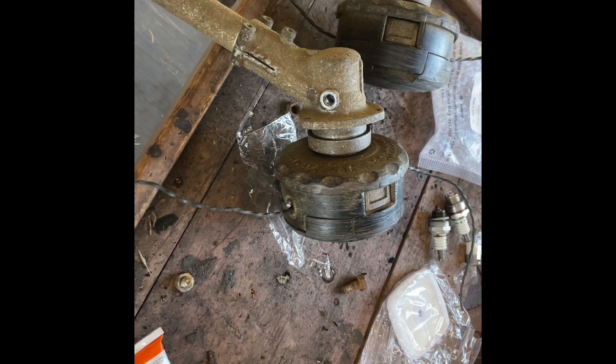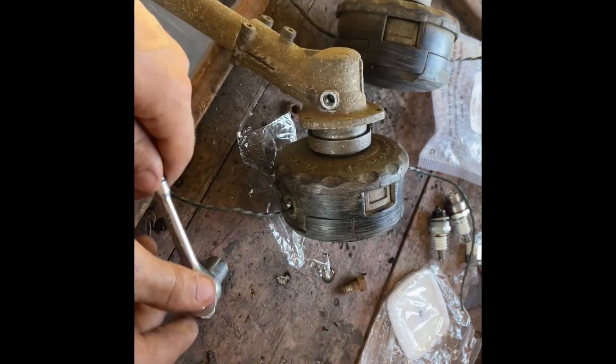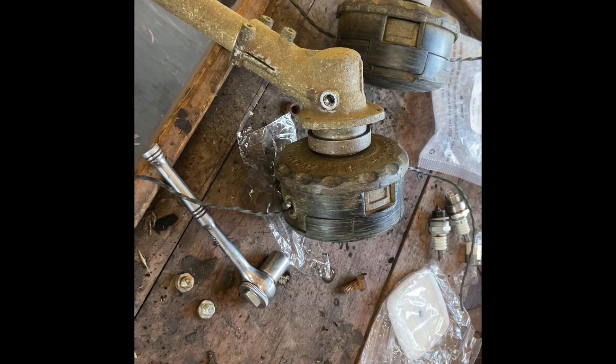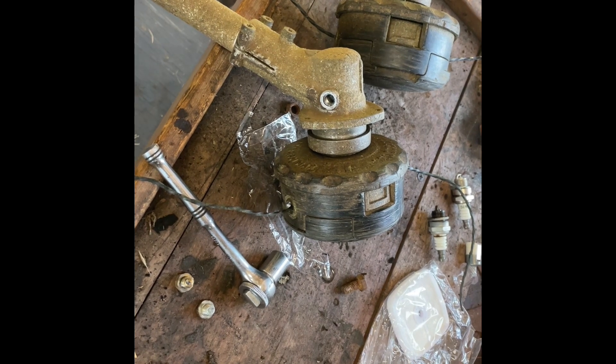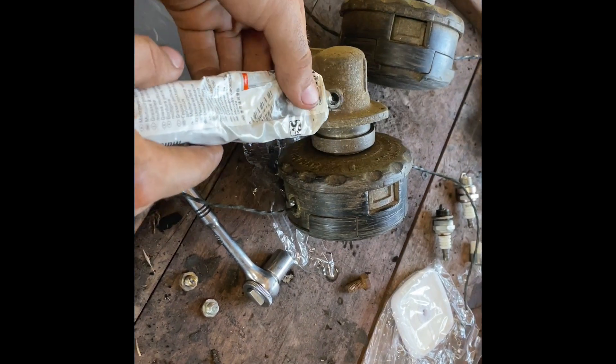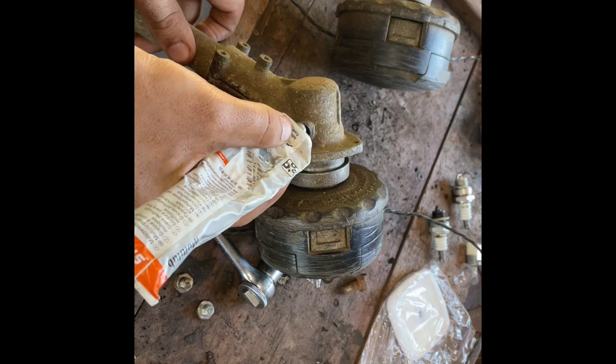It's very important to grease these heads — there are bearings in there, and keeping things greased makes them last longer. I've heard that a lot of the new trimmers now don't even have grease bolts on them anymore. They're just non-greaseable heads.